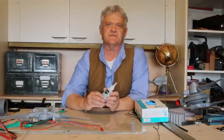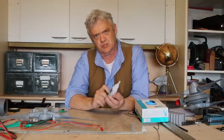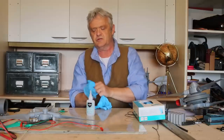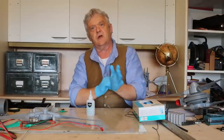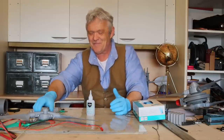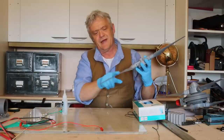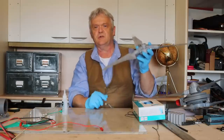Coating the blades with superglue really is a piece of cake. This superglue comes in a range of thicknesses — you want the thin, watery precision superglue, not the jelly-like kind. I'm using nitrile gloves; the superglue won't get through them in the short time we'll be using them. It does stink, so work in a well-ventilated area or outside. Just put some of the thin superglue onto the blade and smear it with your finger.